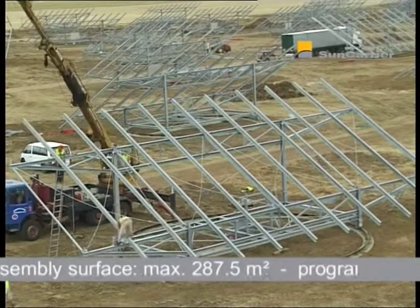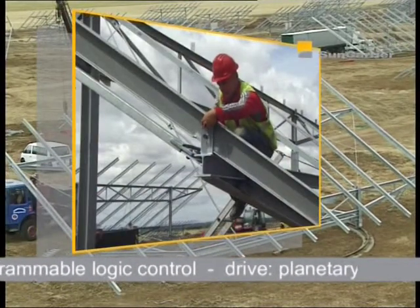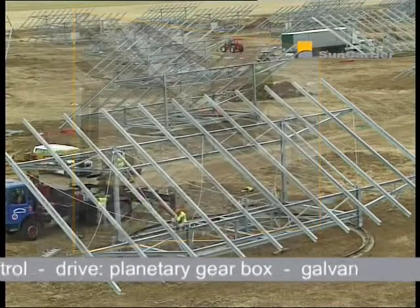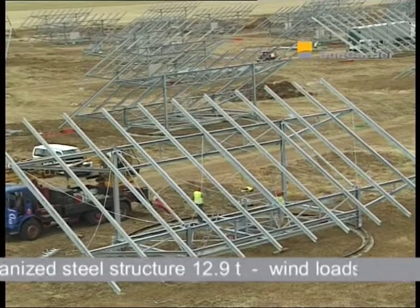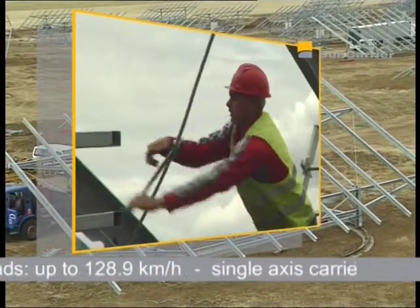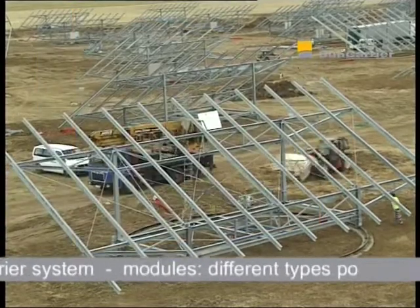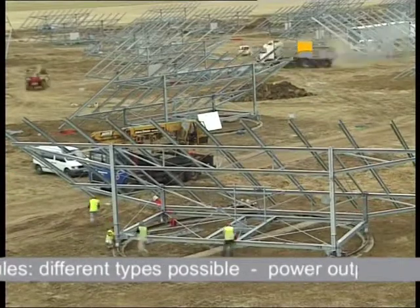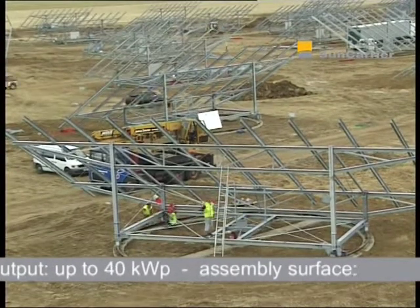The free fields of the supporting structure are stiffened and fixed by tautening the pull rods with the attached turnbuckles. This ensures high stability and a strong foothold of the Sun Carrier. A massive anti-derailing device, which is attached to the Sun Carrier and reaches under the head of the railing, ensures that the Sun Carrier cannot be lifted off the rails even by strong winds.